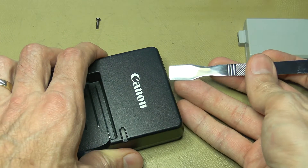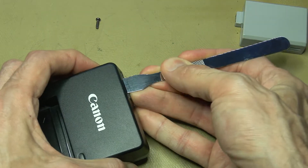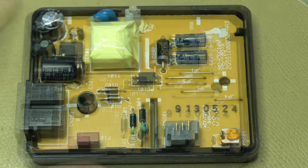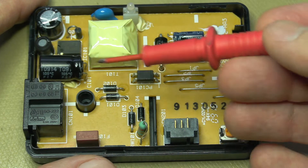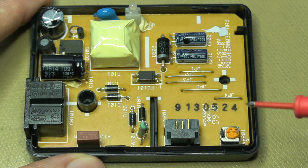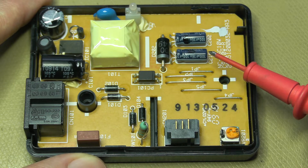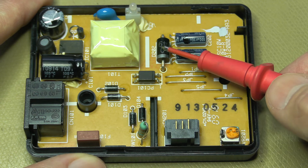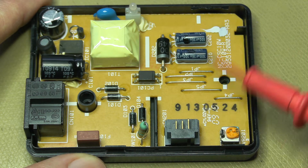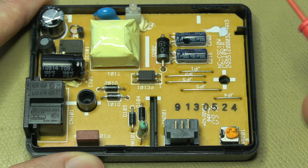Let's quickly crack it open. On the top we have the bulk capacitors over here, and I suspect these diodes are probably the diode rectifier bridge. This is an optocoupler probably between the high voltage section and the low voltage section. There's a diode for rectification on the DC side, DC caps — it's quite likely these two caps are in parallel. And here's the charge port.